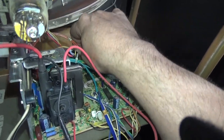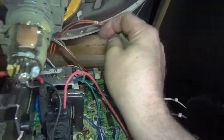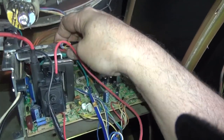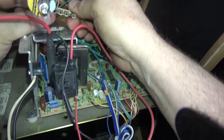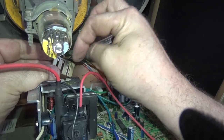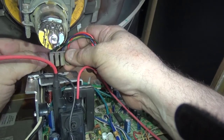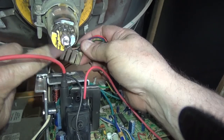The next thing you're going to remove is the tube plug and degaussing circuit — that's this ring that goes around the tube. It clears and purifies the color when you first turn it on. Then back here you're going to unplug the yoke. You'll notice all four pins are intact, but sometimes in an arcade game it's been cut in half into two separate plugs because somebody split it apart.